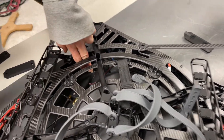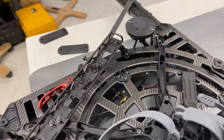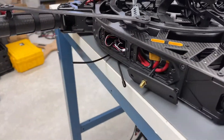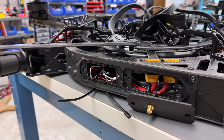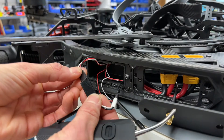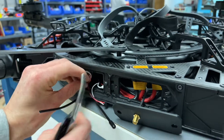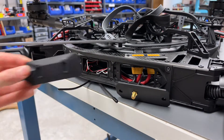You have your S+ cable which comes around to the back of the drone to this little access hatch. I have it open here. This is what it looks like closed — you take that off. And then you have your different S+ cables. We've arrived to deal with the servo whip, so you're just plugging in your servo connector here. And then you can just push the rest of the wires in there and close that back up.